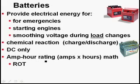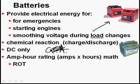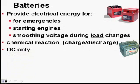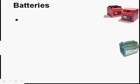Okay, amp hour rating. All airplane batteries have amp hour ratings, and that's essentially how much energy will they store. Cars typically, CCA, car batteries tend to rate their batteries in cold cranking amps. How many amps can you get out of it at a certain temperature? But we don't worry about that in airplanes. We're worried about how long will the battery last if something goes wrong. So here, we'll try it. Here's the formula. Amp hours equals amps times hours.